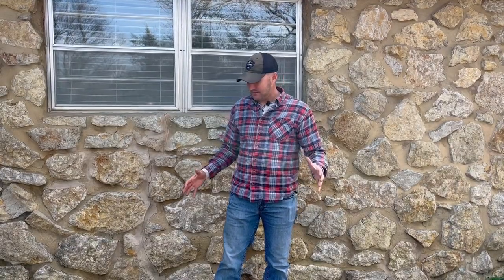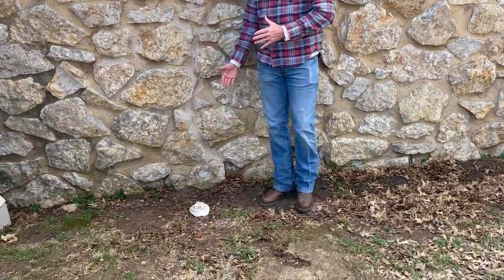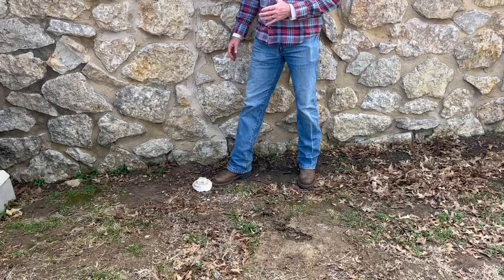I'm going to break down exactly how an aerobic system works, not in grand detail but in basic detail, so you have an idea of how this whole system flows. When your house gets plumbed, they stub a pipe out of the foundation, and then you have a clean out which allows a plumber to go clean anything that gets stuck outward or into the house — they can snake it from here.